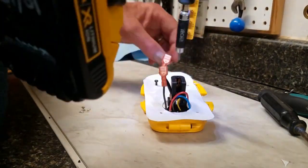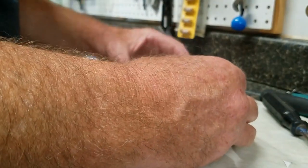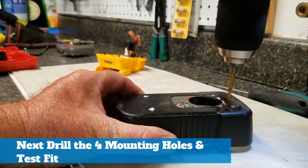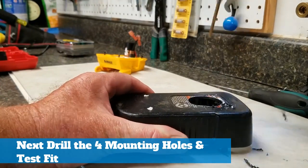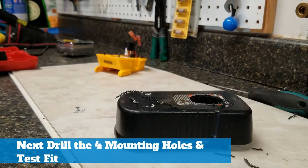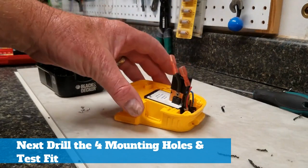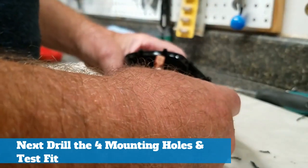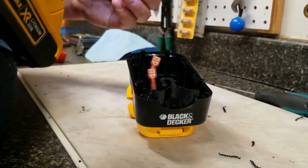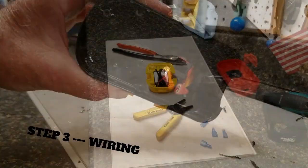Once you have your four holes on the paper pattern, line it back up again using the center hole and the sides, mark with a scratch awl, and drill the four holes. Try to stay as close to your marks as you can. If the test fit doesn't line up exactly — which it never has for me — you can ream those holes out a little with an eighth-inch bit. But be careful: the screw heads aren't large, so if you make the holes too big, the screws will pull through and won't hold the two halves together.